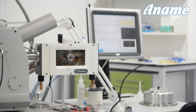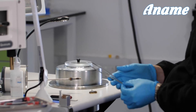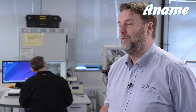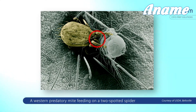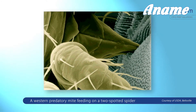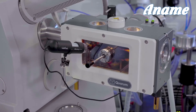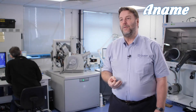The system comes with its own preparation area, which also supports the PC and has its own integrated slusher, allowing you to load pre-frozen samples very easily and simply. It also means you don't need an extra desk for preparation work in the laboratory. The system has been demonstrated on many different microscopes to have excellent drift performance and very good high-resolution imaging capability. A CCD camera is fitted to the preparation chamber, allowing you to take images of your sample — perhaps before and after you fracture it — and these can all be saved to a USB disk.